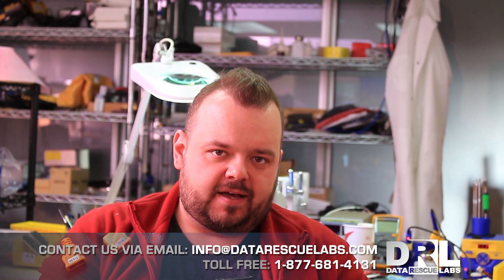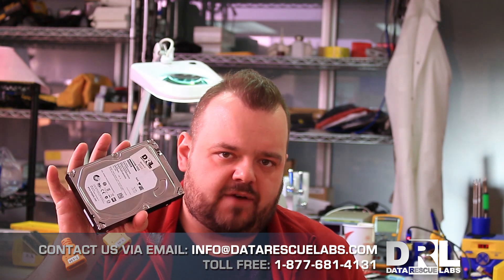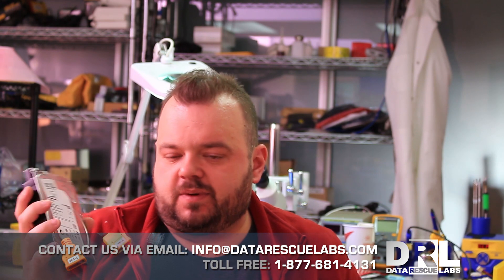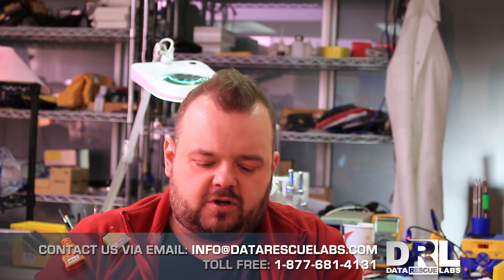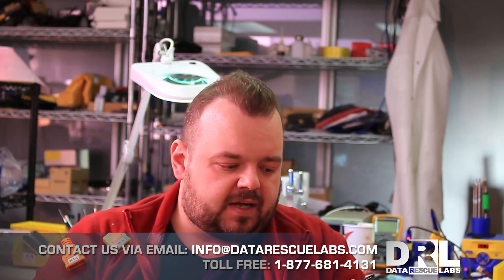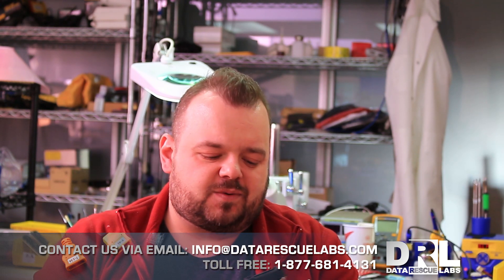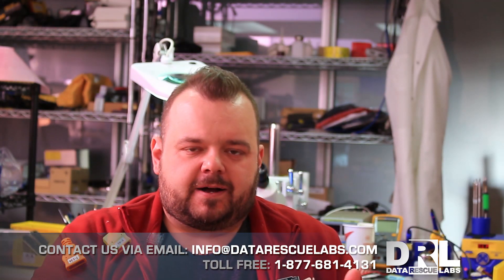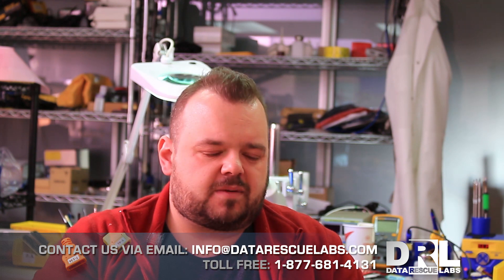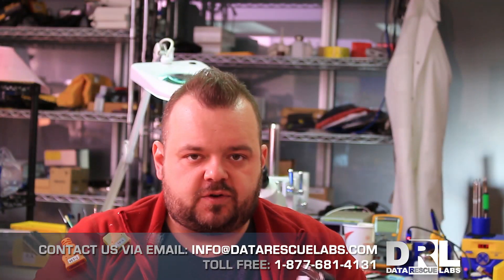How's it going everyone. Today it's gonna be a short video of a fairly simple recovery — it's this Seagate drive. It doesn't matter what drive this is, it could be a Maxtor, it could be whatever. This is one of those jobs that we thought was gonna be difficult, but it's a simple job. The drive wasn't responding. We tested the board first and the board was bad, so we fixed it, put it back on, and recovered the data. There were some partition issues which we fixed, so there were no major issues.